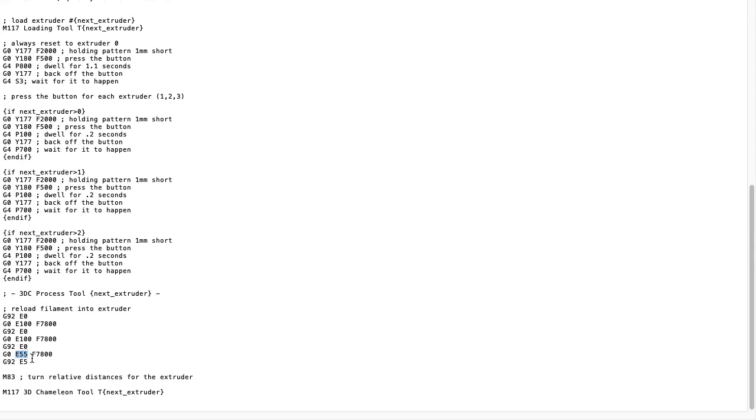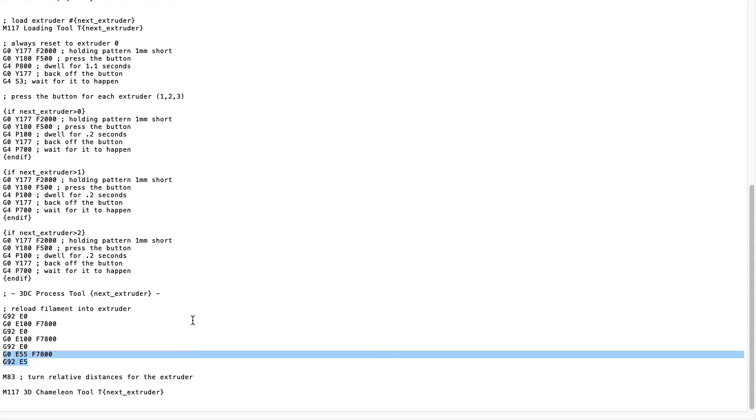But when you do that, you want to make sure you also adjust where the extruder is actually at. So, for example, if you set this to 50, you're going to set this to 0. So that last digit, 0, is also going to be this digit here. So if you set it to 53, you want to set this value to 3. That way it doesn't automatically create a blob before that. So generally, I just leave this alone, and you should never have to worry about it.